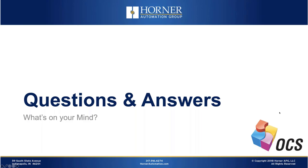The first question is from Carlos: you mentioned shipboard automation as an example of applications for the XL series — would you please elaborate on any certification the product has? The XLE, XL4, and I believe the XL7 all have shipboard certification. Some of the models have a certification for use on board ships — they're very often used to interface with diesel engines and monitoring systems on the ship, as well as for temperature control and environmental control.